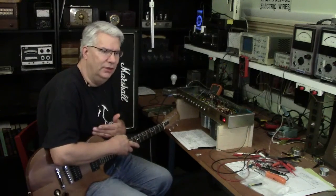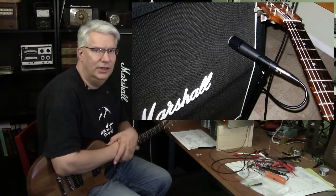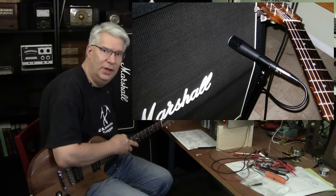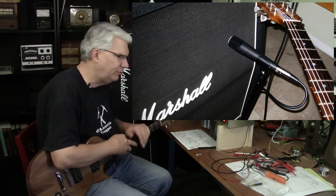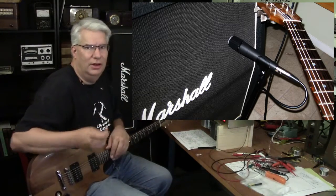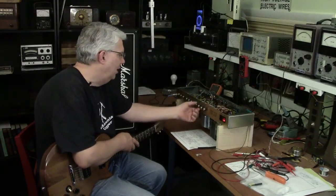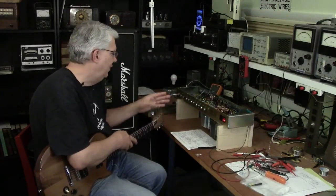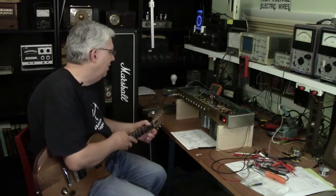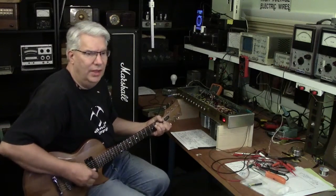Well, I got it plugged in here. Let's go ahead and take a listen to it. I did go ahead and buy a GLS Audio ES57 microphone. I got that right in front of my 1960 cabinet. And I got one of these USB to XLR adapters. So I have the amplifier on. The reverb is turned off. Pretty much everything is set around 5, and my channel gain, the boost gain, is right around 3. So it sounds really nice.